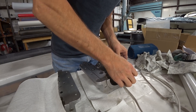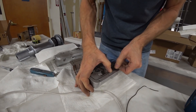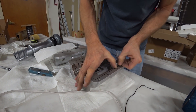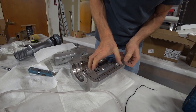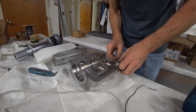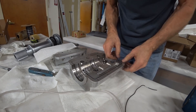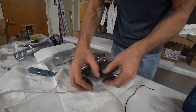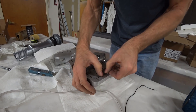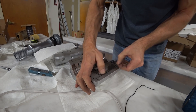The next job was this o-ring material that goes in a slot machined all the way around the housing on one side, machined with a dovetail profile. I'm stretching out the o-ring material to get it into the dovetail, but I found I was stretching it too much, so I pulled it back out and stretched it a bit at a time, then pushed it back in so it's under minimal stretching load.